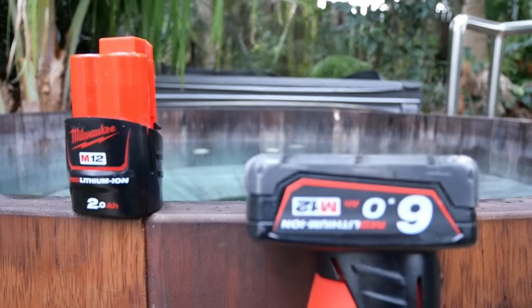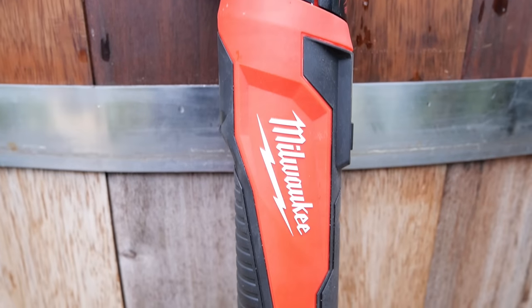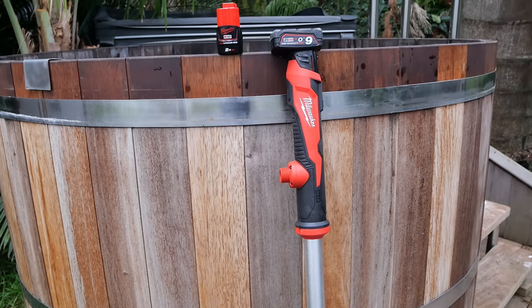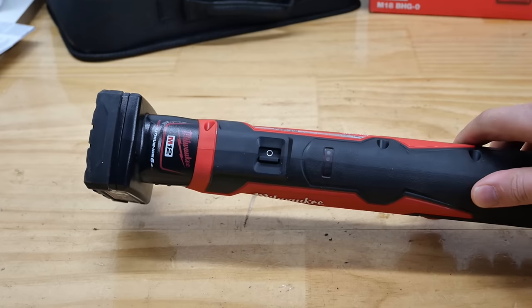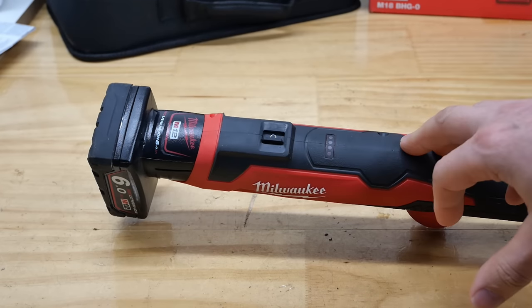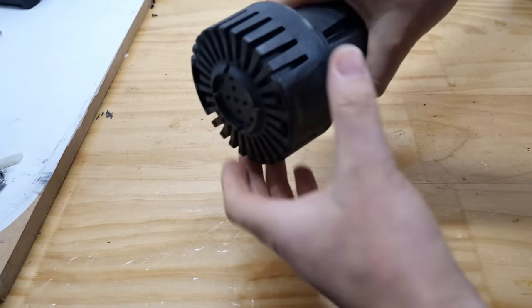It will take around one hour to use up those two batteries and drain this tub. But this thing might be quite handy just for sucking stuff off the bottom, as I said earlier, although ideally it really does need to be a little bit taller because this is one deep tub. Just remember if you do use it in chlorinated water, or even salt water or dirty water, just flush it through with some nice fresh clean water afterwards. Don't go putting boiling water through it — it's rated up to 60 degrees Celsius, which is about 140 Fahrenheit. And don't put flammable liquids through it — no petrol, no acids, no stupid things. It's for pumping water.